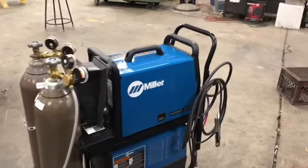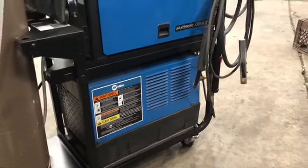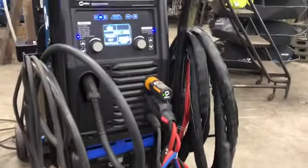So when we're doing that, we like to have a water-cooled torch setup. We got a CoolMate 3 off of Craigslist and put it on with our system here. In order to do that, we purchased a CK Worldwide power block that allows everything to recirculate from the water cooler back through the torch.